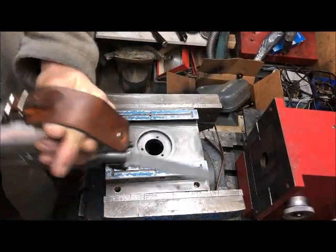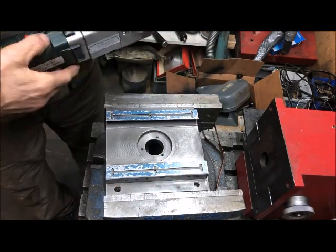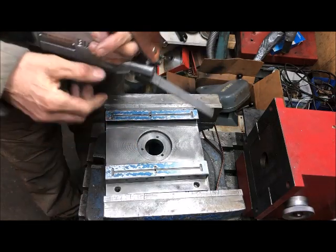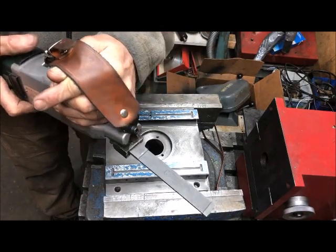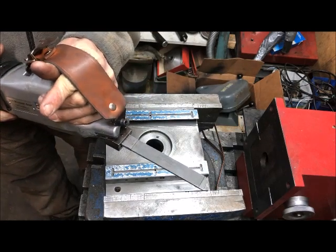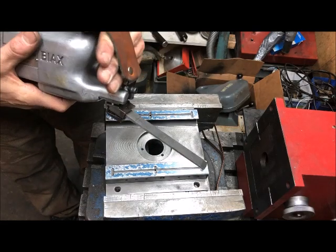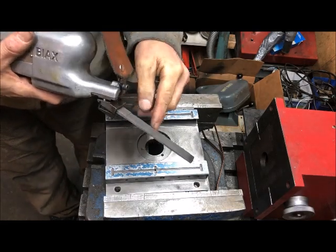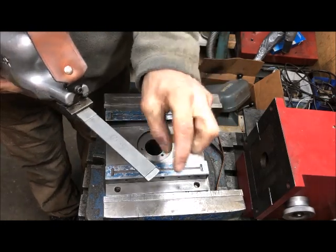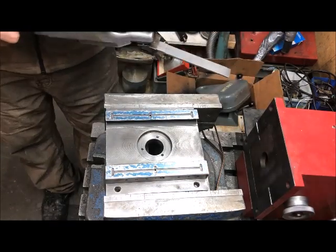For now I'll just use some time to scrape the saddle here. I've done one pass with the biax this way, so I'll do this way now. I've rough scraped it with the hand scraper but I have such small narrow areas - it's much better to use the biax. I set it at fourth stroke, adapting that to the technique, the stage you're in, the curvature of the blade, and also speed.